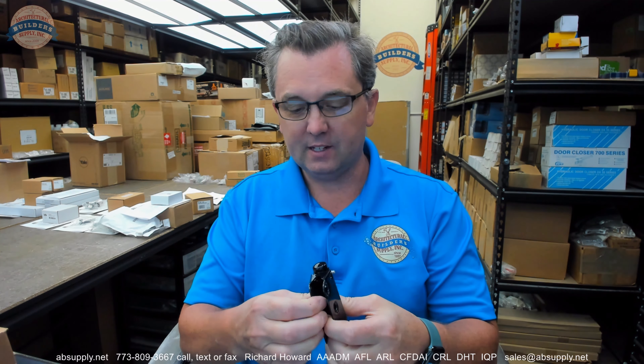This is not the spring hinge you are looking for. This is an unusual variant of the 2100, meaning it's an R or a reverse action. So this sort of hinge is probably not the one you want. If you're looking for a full surface storm door, wooden storm door, screen door, self-closing hinge, you probably want just the 2100, not the R2100.